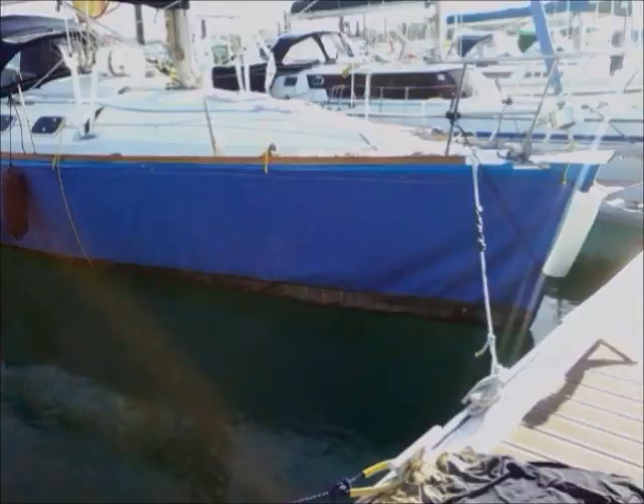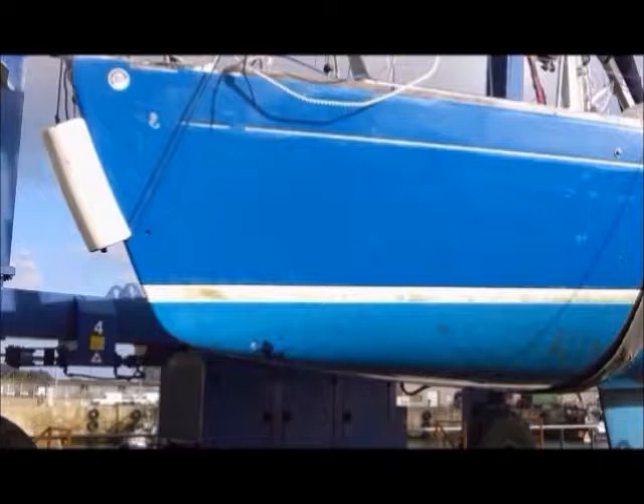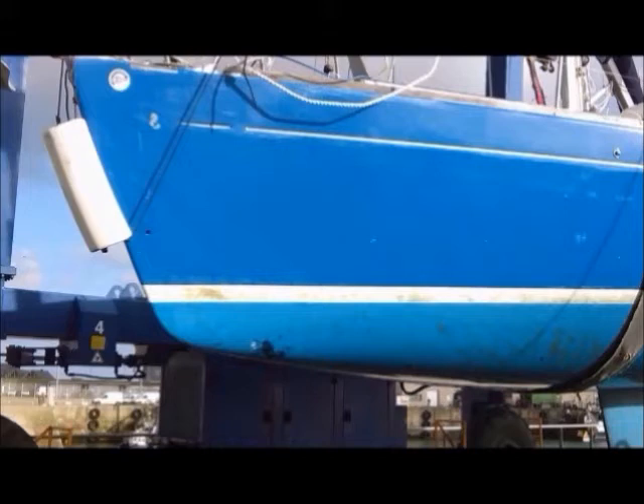This photograph of a rudder shows marks where fish have just grazed against the side of it — it's easily cleaned. As a friend of mine once said, all we need is a shoal of well-trained guppies and your boat will be cleaned. BioDoc doesn't just anti-foul — it protects the whole boat. The topside cover protects against bumps, scratches, and damage from the sun's ultraviolet rays. The cover will weed up if left unattended for any length of time, but it is easily cleaned. The boat used to test the prototype was already fouled before BioDoc was fitted; within 48 hours all the weed had gone and the boat was completely clean. This is the result after three years of continual use: no weed or slime, the prop shaft and propeller were in good condition, and even the anode still had life.